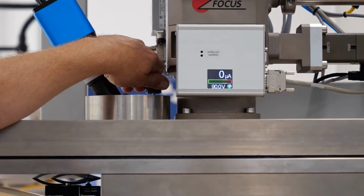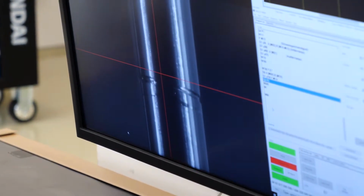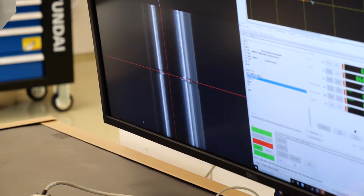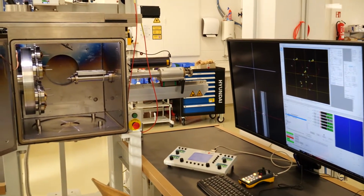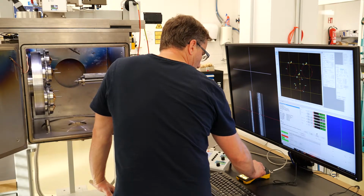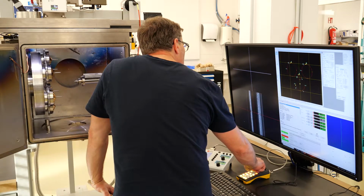This little button you can tilt. You can see now on the optical image, I'm shifting forward and backward. So you're able to adjust the zero axis, let's say, of the optical camera, right? It's a mechanical thing. It's just tilting a prism to the right position. So adjustment of the entire unit manually is done through a remote control panel, as Thomas just does it.